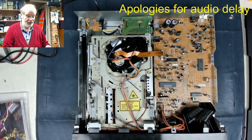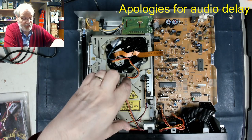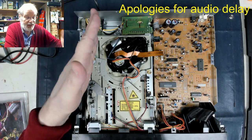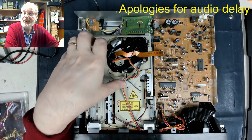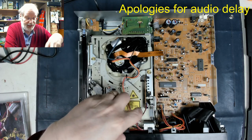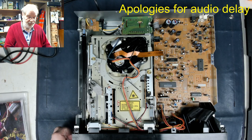But basically what you have is you put the cartridge in, then you've got a mechanism which will draw that cartridge into a certain position, and then you've got another mechanism which will load each tray, spin it out underneath the disc, underneath the optics. The optics would then read it and see if there's a disc, and if it couldn't read the first disc, it would put that back in and try the next. So what we'll do is we'll fire it up and we'll pop the cartridge in like so.